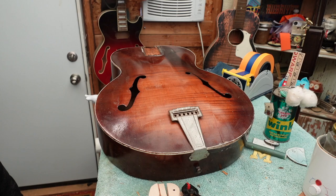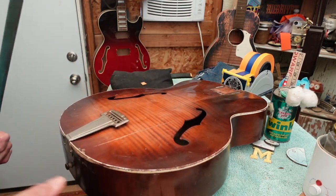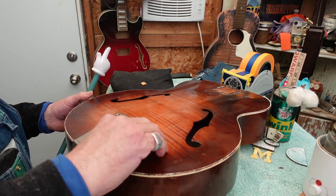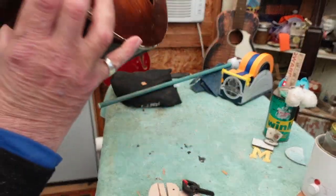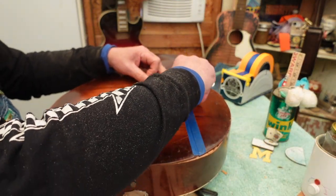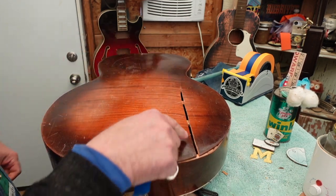We've got an offset — you see that — we're going to have to fix that. Let's have a look at what the bottom looked like — we have a big crack to deal with down here, and I wanted the edges — the top surfaces of this crack — to be as level as possible. This is where the splint will go. Now it's time for some tricks. There is a gap right there and it cracked all the way up to where we put the cleat.